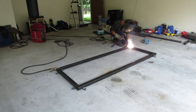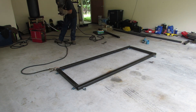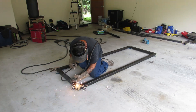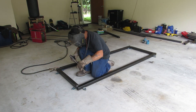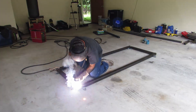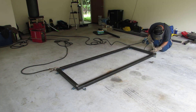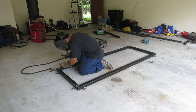I got some of those pieces clamped up right now. This is gonna be the top part of the frame that the surface is gonna sit on. I made sure it's square by measuring corner to corner, also making sure all the pieces are meeting up at an even height so one side is not higher than the other, and making sure nothing's twisted. There are little clamps — I think they're for woodworking — but they seem to work pretty well for small stock.